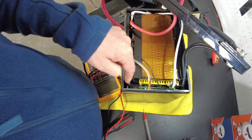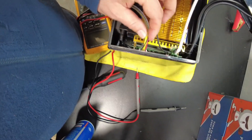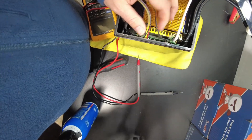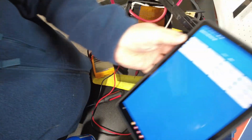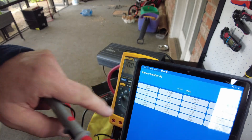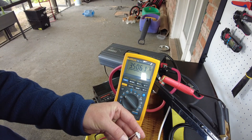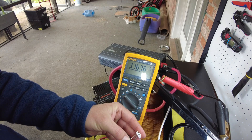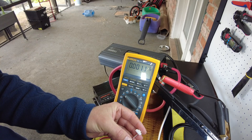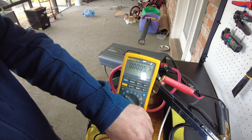I'm not going to rip these cells out — there's a lot of glue in the corners and I don't want to cut my hands up anymore. What I am going to do is pull off the BMS sense wire leads and measure to make sure the readings we're seeing in the app correspond. We're at 3.8, 3.8 again on those two cells. Measuring: 3.5 on the first cell, 3.76 on the second, 3.74 on the third, 3.38 on the fourth. I pretty much think that what the BMS is seeing is correct.